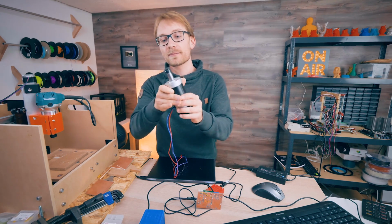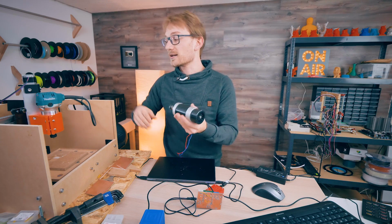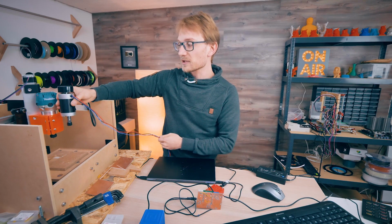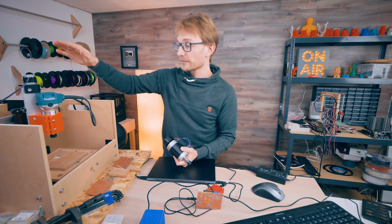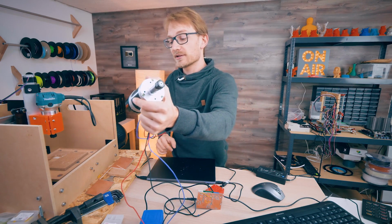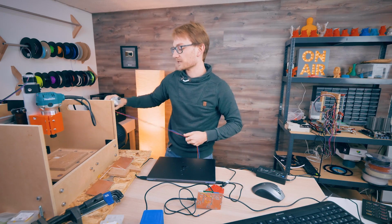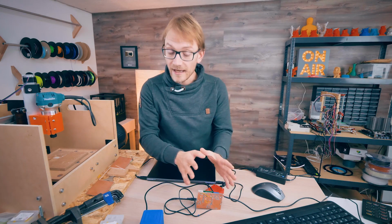This is a brushless version. Even though it looks kind of janky, the runout on these is actually very good, and it's a lot lighter than the Makita tool. Doesn't spin quite as fast, but I think it's just more suitable for this sort of setup. And it has the ER11 collet right in there, so you can chuck up the 1/8" tools perfectly without any need for adapters. But of course, with the parts that are already on the CNC, we can make PCBs.